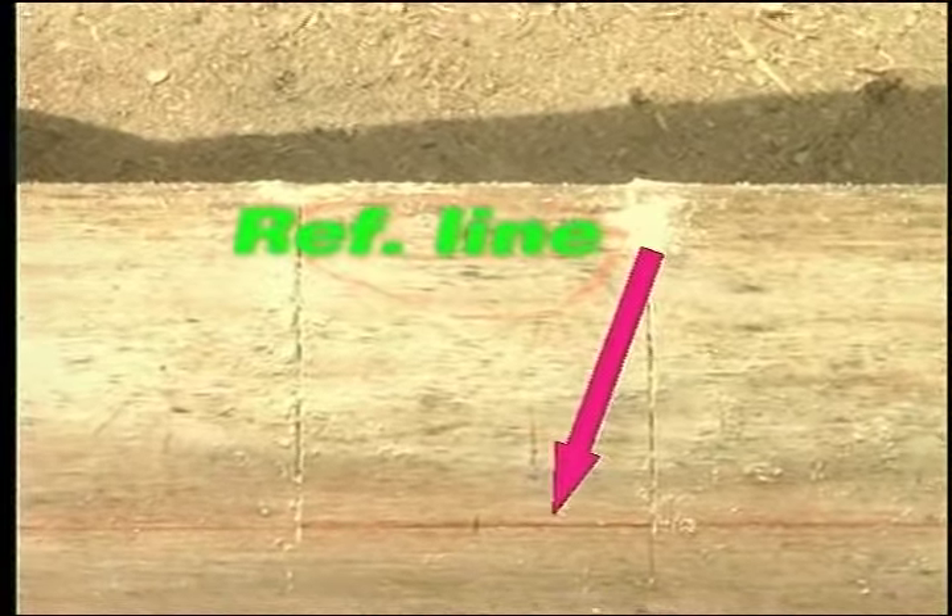Next, prepare the end of the cap log by cutting it flat on the sides, with a step on the bottom to allow the soffit material to be entered. Common rafters of the design dimension are put in place. They may be notched over a cleat on the plate log or secured with metal nailing clips. These rafters should be pre-cut, and the work will be easier if the rafter positions are marked on the beams before the ridge and purlins are hoisted onto the building.